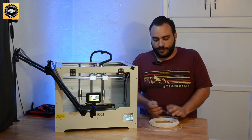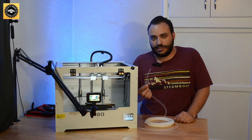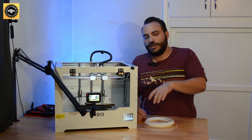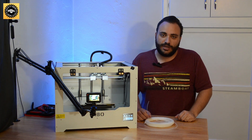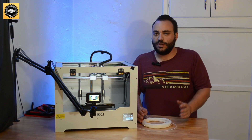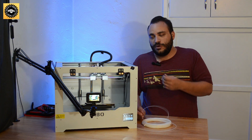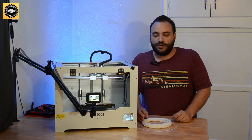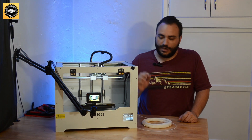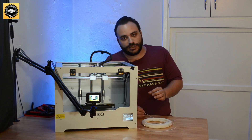The first question is probably: what is a cleaning filament? It's a piece of nylon that is intended to flush out any of the gunk and deposits left behind by your ABS, PLA, PETG, or whatever filament you're printing with. Basically you run this through and it pulls the finer particles that get stuck on the inside of the nozzle assembly and will help to prevent future clogs.